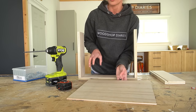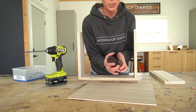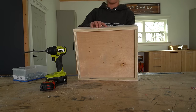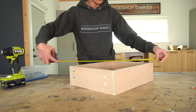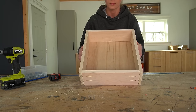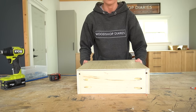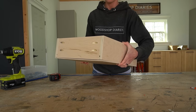Your bottom panel should be able to pull your drawer box sides square, but if it's not square to begin with, it obviously won't do that. To check for square, just measure across the diagonals and make sure they're even. Once I make sure my bottom panel is square, I slide it into the dados and attach the fourth side of the box, then double check that the box stayed square. If the box is not square, you may have to loosen some screws, clamp, and drive them again. If you skip the dados, assemble all four sides, then flip it upside down and use wood glue and screws or staples to secure the plywood panel onto the bottom. Note that attaching the bottom panel this way will make your overall drawer height a quarter inch taller, so you may want to cut your sides a quarter inch narrower to keep your overall drawer height correct.